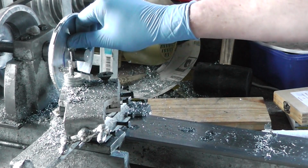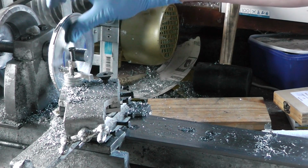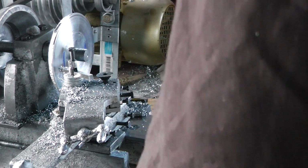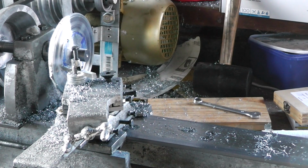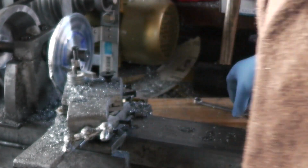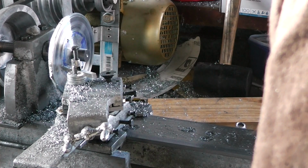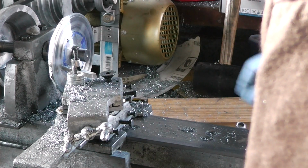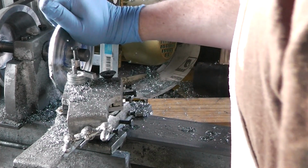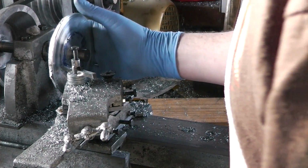Now that I've got this pressed right against the shaft collar itself, it can't back off like it was, so I'm able to finally put in some real tool pressure. I'm getting a very nice surface finish with this high-speed steel. It's a lot slower though. Like, I can't take out huge chunks like I can with the carbide. It's also making the piece heat up quite a bit.